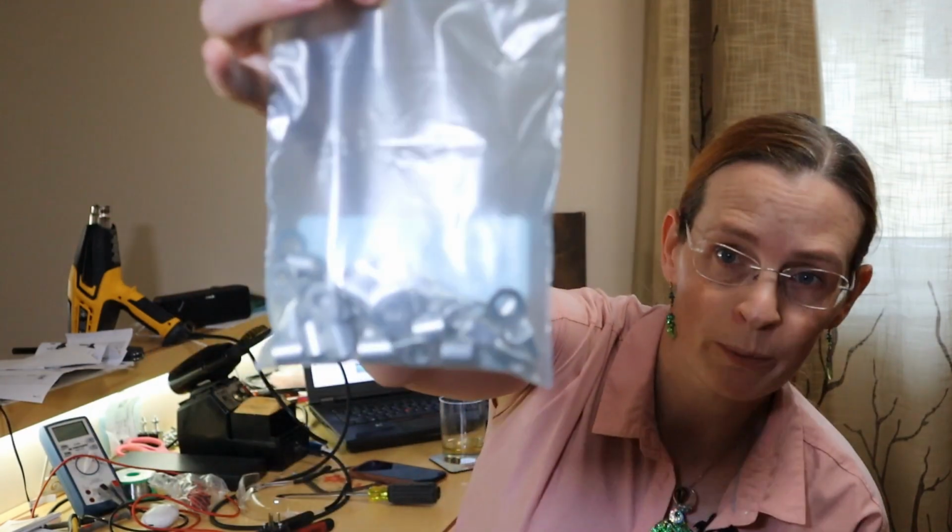A lot of people, when they're building these batteries, use welding wire. If you're not in a marine environment, I'm sure it's great. If you're going into a marine environment, no. The tin plating on the copper strands in these wires goes a long way towards preventing corrosion. I don't think I've mentioned it, but all of the ring terminals that I buy are also tin-plated copper. Again, to try to minimize corrosion out on the water.